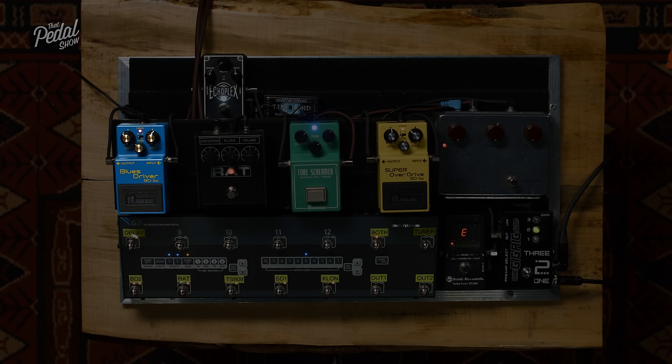Now you've got those three circuits, three lines basically hitting that summing amplifier. If we add those together, you have this massive increased range of amplitude. The summing amplifier is basically a TL072 op amp, but it's powered by 27 volts to give this massive headroom. So obviously you plug a 9-volt in and there's a little power supply chip in there that sends different power requirements to different parts of the circuit.